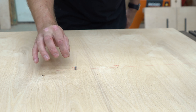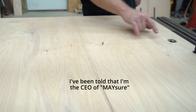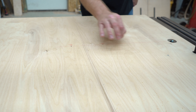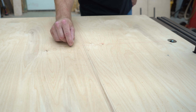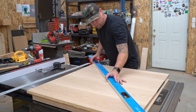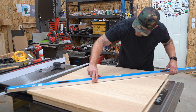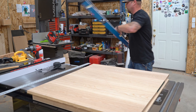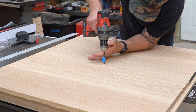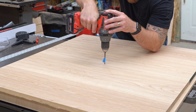See how these fit — pretty good, barely any play. Same. So really anytime I need to cut a new size circle, I can just measure from here and do the radius of that circle, drill another hole, and move the peg as needed. But right now I'm just going to do these two because those are the ones I'm working on. To mark center on the workpiece, you just draw a line from corner to corner, and where those lines intersect should be your center. That's where I'll drill my hole for my pivot point. This is the same three-sixteenth inch brad point bit that I used on the jig — it's a Montana brand bit and it's a perfect fit for that little rod I cut, that pivot point.